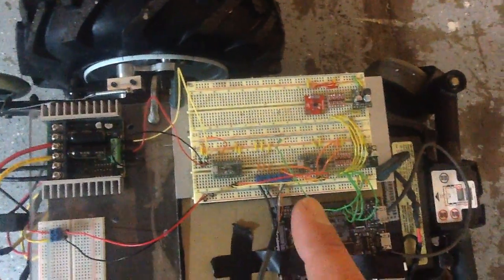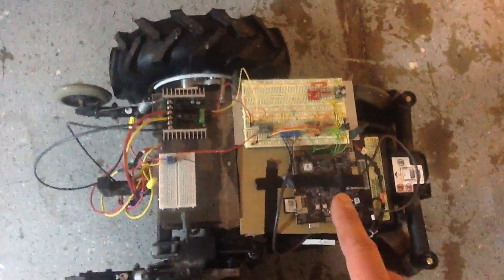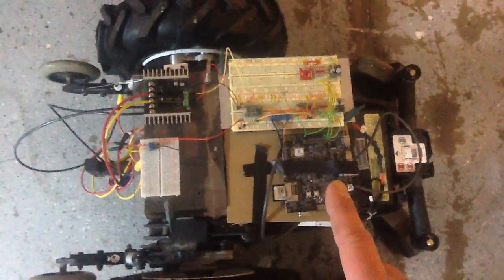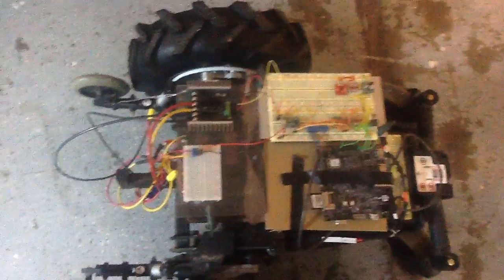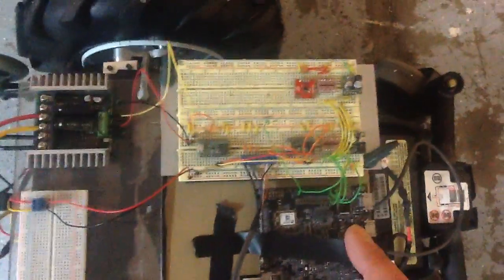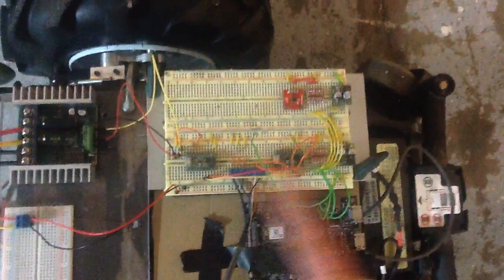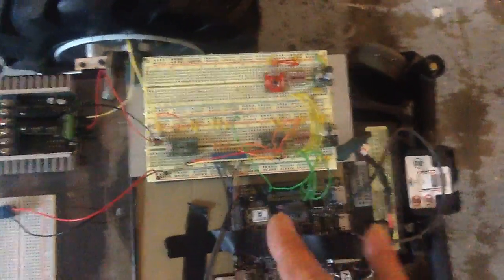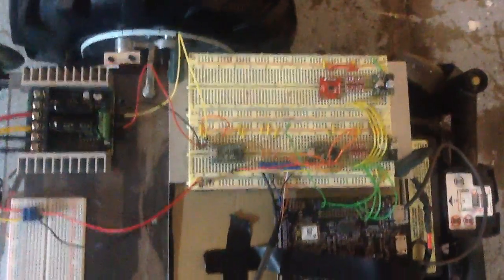Both of them feed into my Panda board via I2C, which is really nice. I used to do this kind of stuff with a Raspberry Pi and an Arduino communicating over the serial line, which works but it's kind of slow and unreliable — you have to scrape a trace off the Arduino to get it to boot and communicate with the Raspberry Pi, run commands at startup to condition the serial lines, all this ridiculous stuff. This is just way better. On the Panda board it's like a bus — just two wires coming in, then chaining off to all different devices. I'm really liking this I2C arrangement.